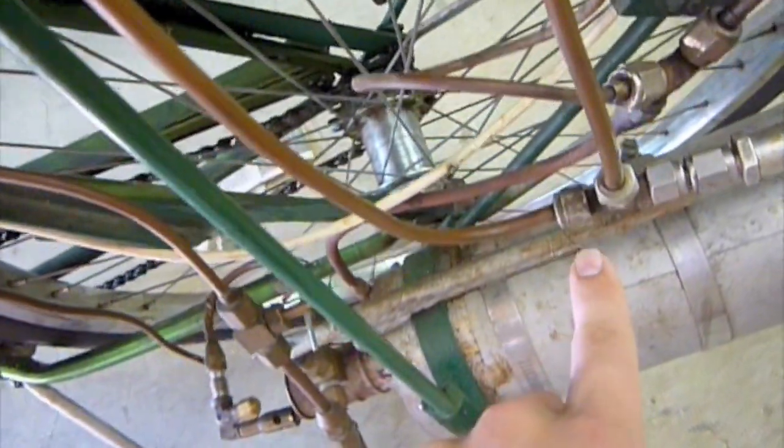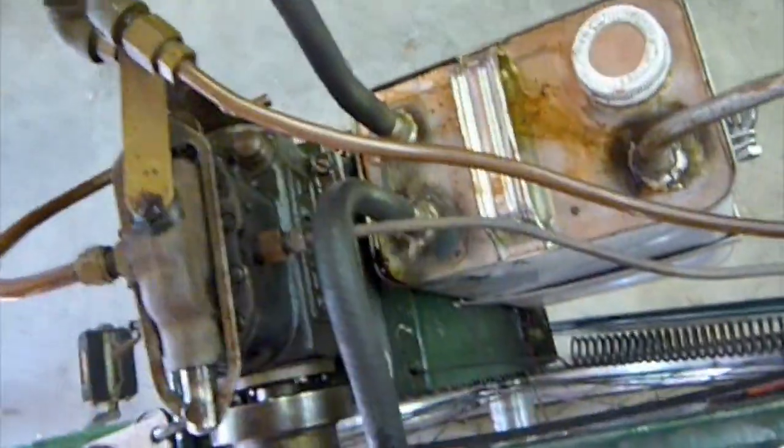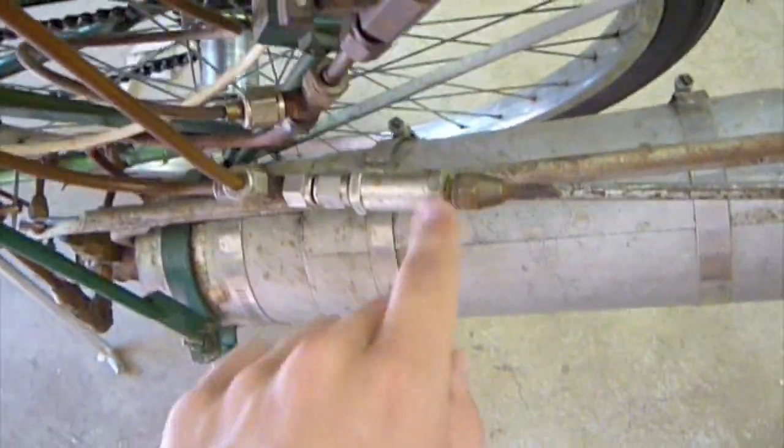Now I've gone through all the parts, let me explain. Basically the water comes from the tank up into here, gets sucked into the water pump, then gets pumped around and back down to here. If the bypass up here is in this open position, the path of least resistance goes through the bypass and back into the tank. If the bypass is shut, the only place the water can go is through this check valve — a one-way check — and then into the boiler.